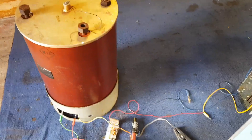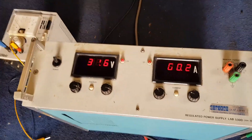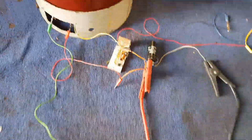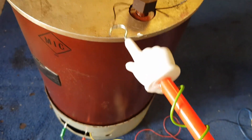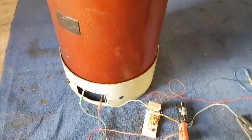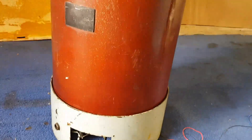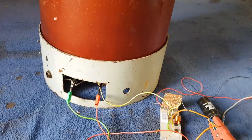I've got this running just now — it's 31.6 volts, only drawing 0.2 amps. And there's absolutely nothing noticeable here. So I think the inductance is just too large. For all it measures quite a low number of turns, I think it's just too big an inductor for the oscillator we have.